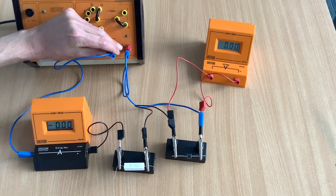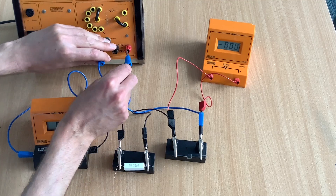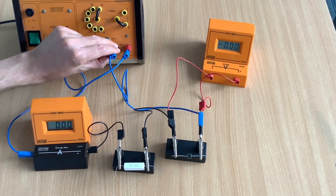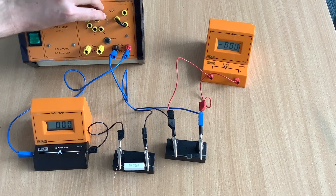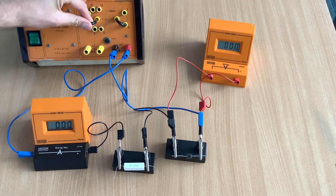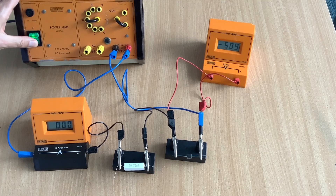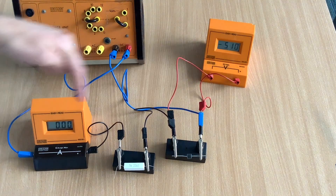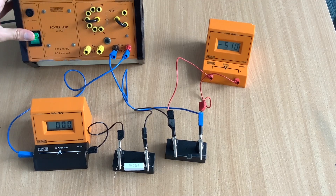So we're going to unplug the power supply. What was connected to the negative terminal we put in the positive terminal, and what was connected to the positive terminal we put in the negative terminal. Then you're ready to turn on your power supply and adjust the potential difference to measure the potential difference and current for the diode connected backwards. We can see we're getting minus 5.1 volts and zero current. You can adjust yours to get lots of points — here we're getting minus 6.1 volts.